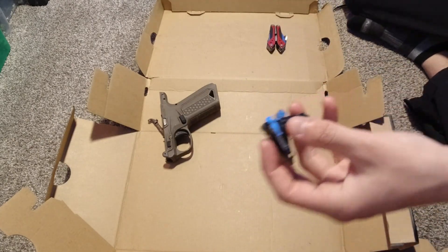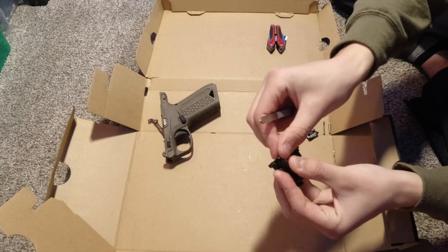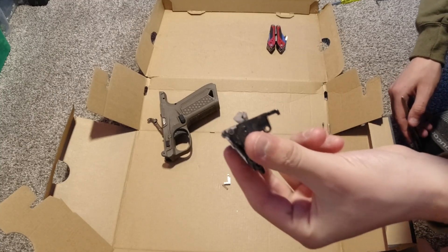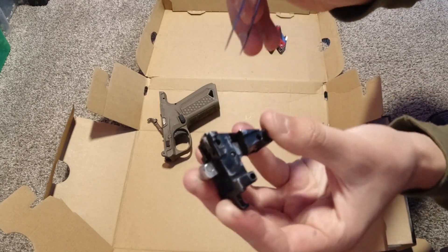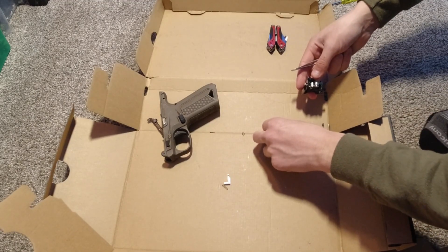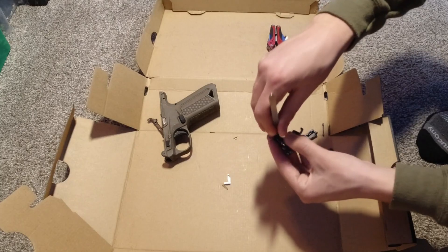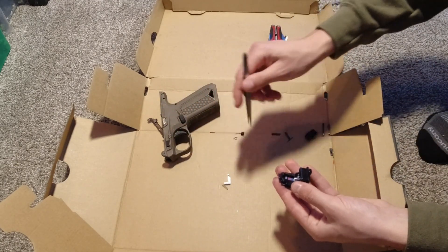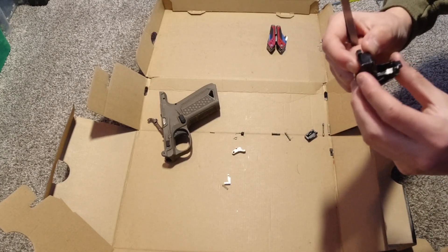This part right here is the firing pin lock. That's originally what broke on mine — it snapped clean off. Go ahead and take that out like that, and don't lose that spring. Now there are going to be two more pins to take out: the first one is right here near the bottom, and the other is right here near the top. Push both of those out. Be wary because some parts may fly off, and there are also springs — you don't want to lose those. Go ahead and push the other one out, and now take out this spring.